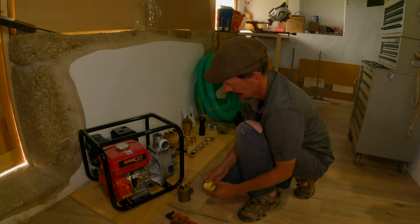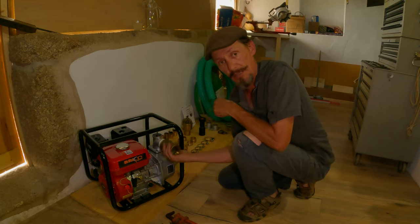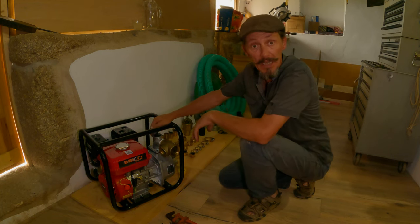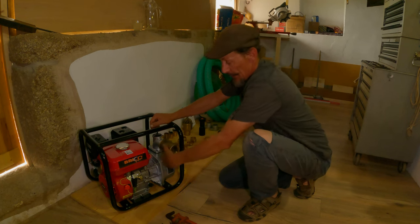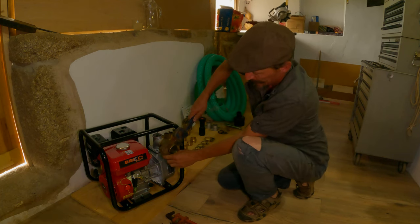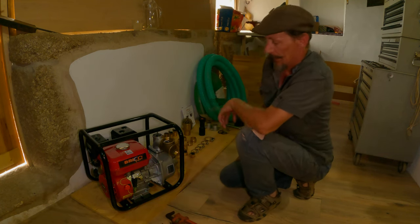Pull the tape to snap it off — now that's ready to start winding on the brass fitting. You can see it's got threads inside it. Always start it gently so you're not cross-threading it, because the last thing you want is to ruin the threads on the pump. These Chinese parts are aluminium and can be easy to damage. Wind it on until you start feeling it getting tight by hand, and that's when the Stilson wrench comes in handy. I want this outlet sitting at the top — and that bit's ready.